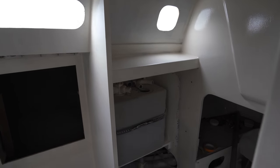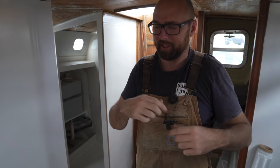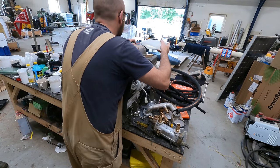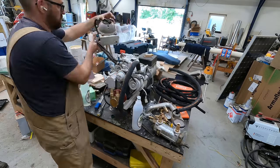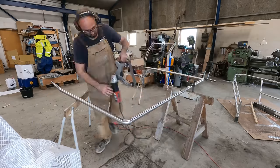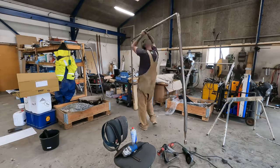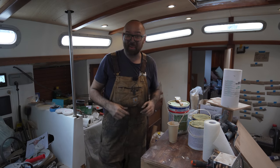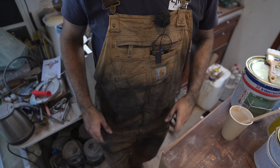This is just the first coat of primer so of course it doesn't look super spiffy, but just seeing everything be nice and white is a big improvement. I'm going to get out of these fumes because the nose hairs are curling — I'll seek refuge up at the workshop. I hope to get my itty bitty Perkins DIY genset fired up on Sunday. In preparation for that I flushed the coolant and poured in two liters of distilled vinegar to clean the freshwater side of the cooling system. Then it was on to the dinghy arch — I got a fresh shipment of sanding and polishing belts. It took about four hours but I managed to finish the dinghy arch and also get started on the pulpit. Polishing is pretty dirty work — definitely do not wear your best clothing.